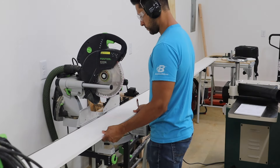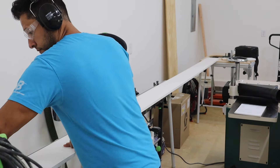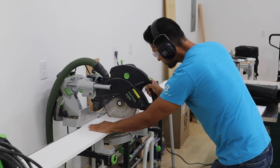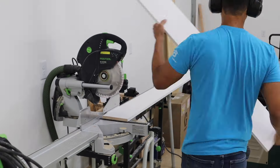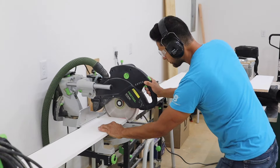The first thing I'm doing here is cutting the boards to length. I'm actually going to oversize the boards because what I need to do after this is bring it over to the table saw. I need to cut bevels on all sides, and then I'm going to cut the miters on all ends, because this is going to be a miter fold style build for this mantle.